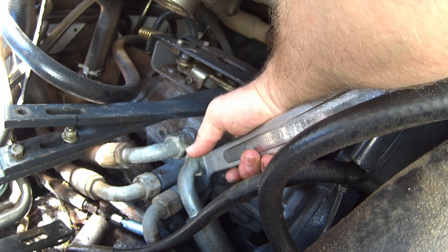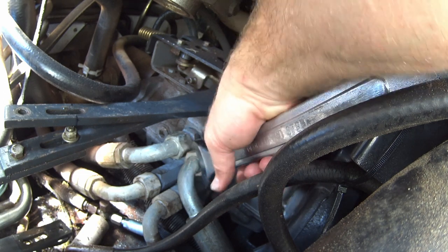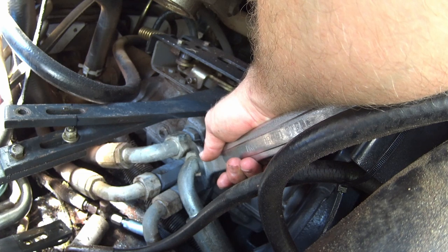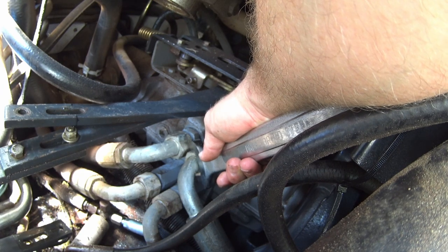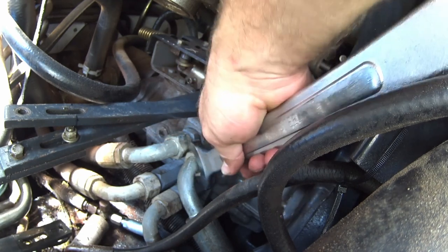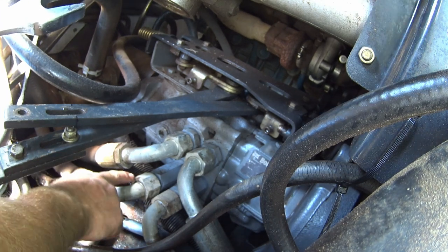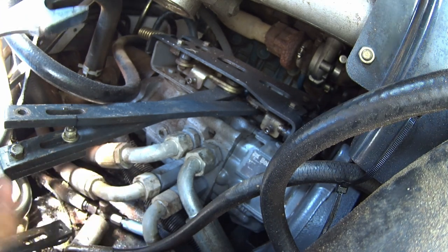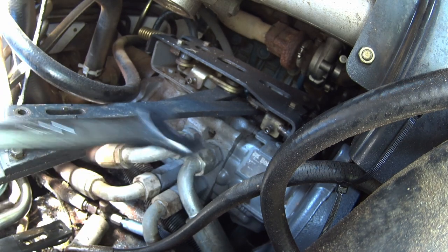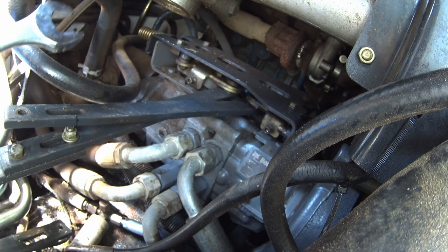I've used a large expandable or crescent-style wrench — the one I've got is probably a hundred years old, made by Buffalo Tool, and it has kind of an S-curve handle to it, which is really good for getting over to the side so you can tap it with a hammer. I don't like adjustable or crescent wrenches though — they will loosen up and the flex in the jaw will start rounding these fittings off. Somebody's already done that — there's a nice gouge in this one down here. At $120 a hose, I don't want to have to replace this thing.